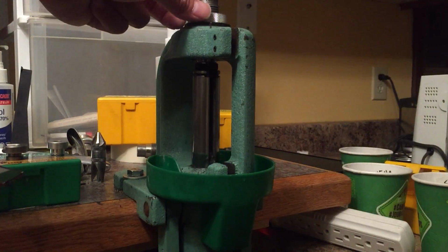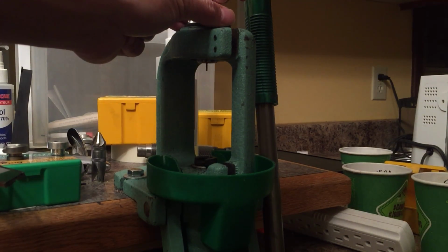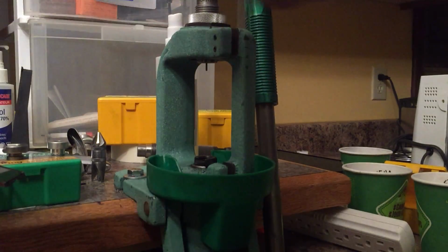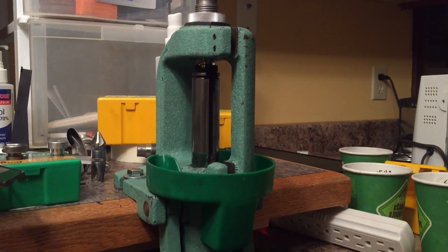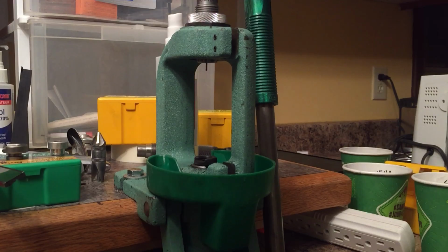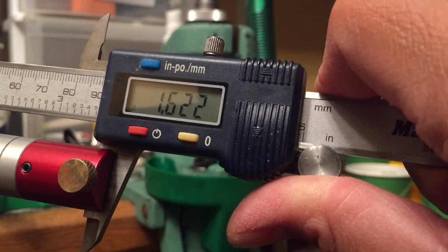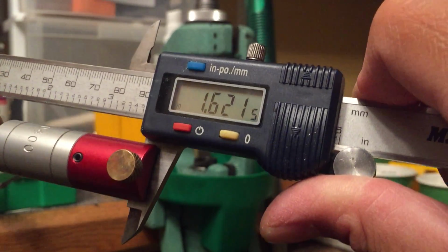We'll find out. So it's already touching, right? So put it in an eighth of a turn. Lock it. Let's put some more lube in, because this case is hardening too right now. And cam over. At first I never really knew about the cam over. Now that's about 2 thou right there. 2.5 thou back. A bit more now. 3 thou. 3 thou bump.